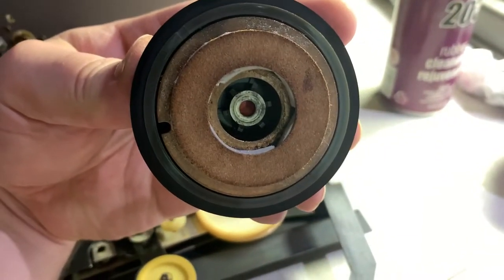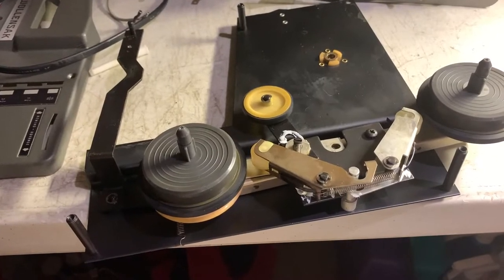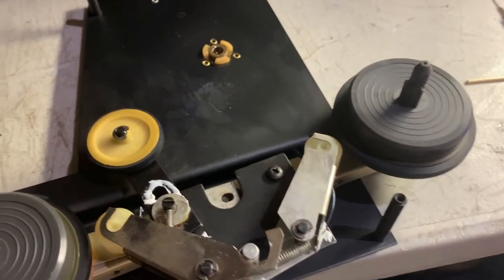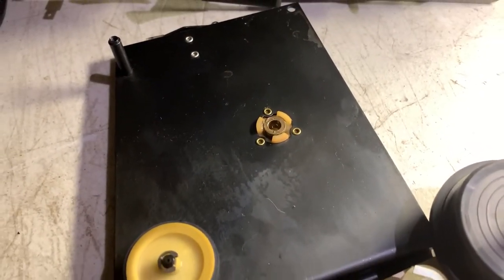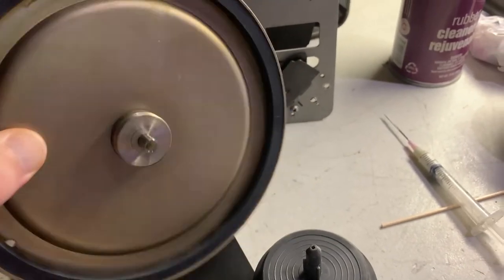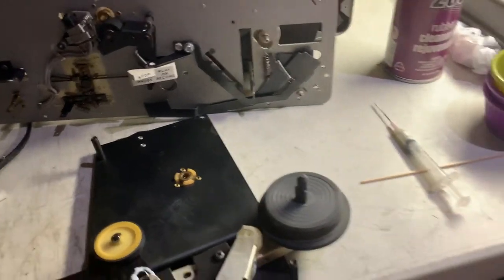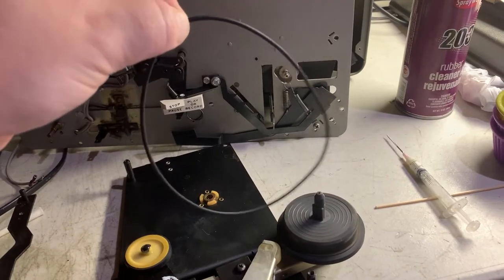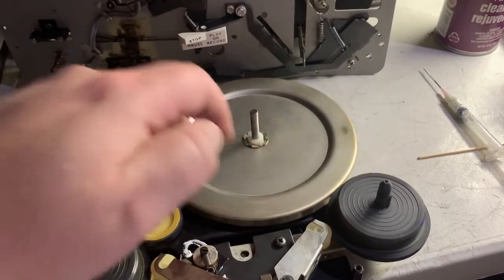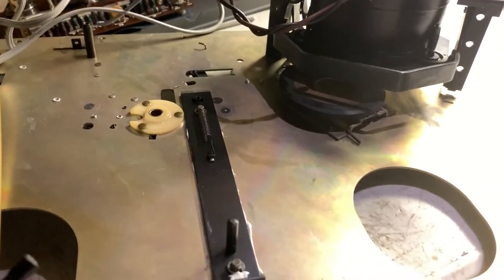Just re-glued foam onto the leather and tried to cut it out as well as I could — it does work. I've now done lubricating everything: fresh grease, cleaned out the old stuff, put some fresh oil in the bearing. Now we're going to put the flywheel — this big heavy one — back on. I was also able to rejuvenate the old belt.